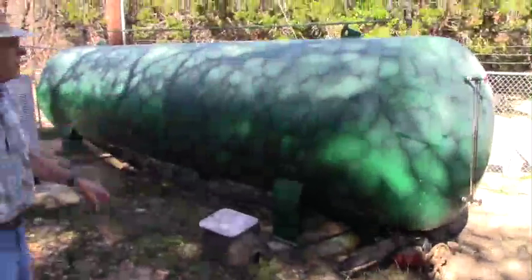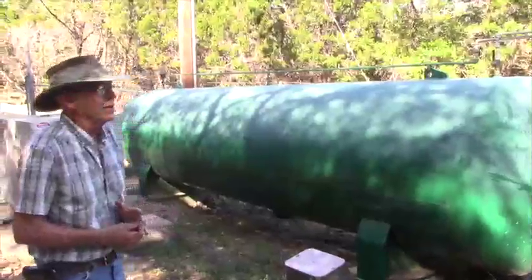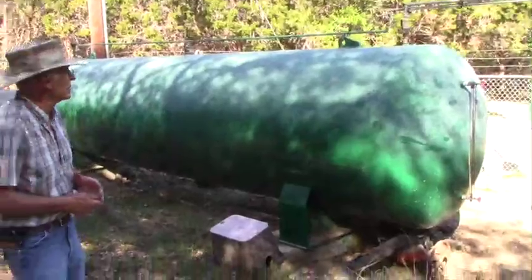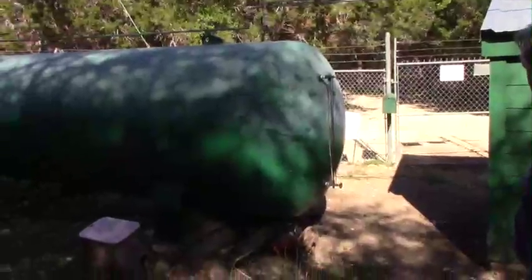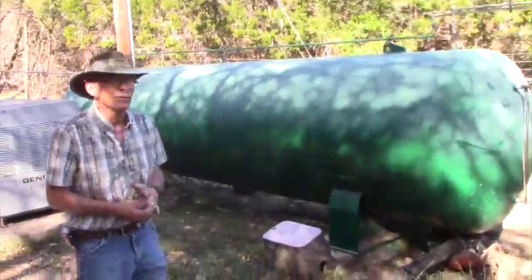This is the high pressure tank. The old tank installed in 1985 sprung a leak around 2006 — we bought a new tank at that time and installed it. We usually keep it about half full. The top portion has compressed air in it so that we maintain uniform pressure on the distribution system at all times.